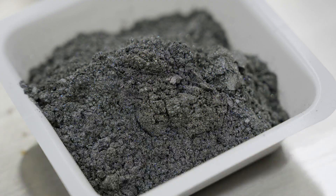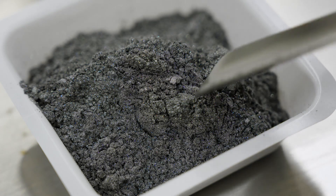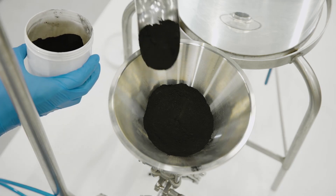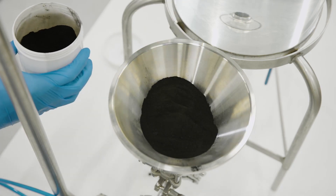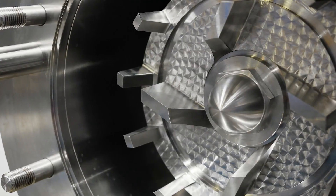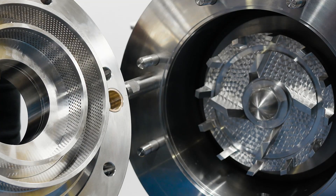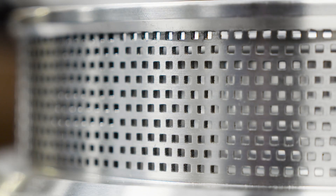Active ingredients and additives for conductivity are generally used in pre-micronised form, but particles do have a tendency to re-agglomerate. The milling action generated in the gap between the tips of the rotor blades and the inner wall of the stator in the precision-engineered Silverson workhead will ensure active ingredients are finely dispersed into the medium, with any re-agglomerated particles being reduced down to the finest constituent parts.